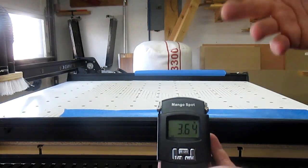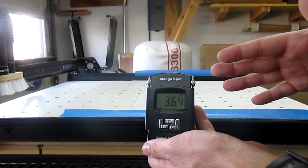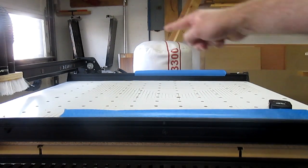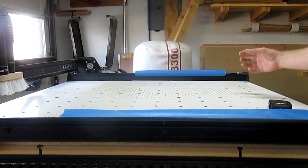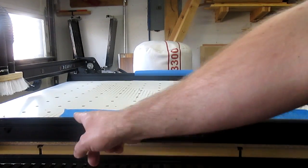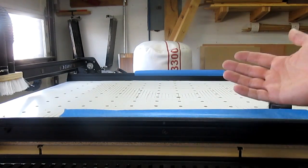I'm just looking for rough estimates here. For me, 3 and a half pounds seems to work really well. That's all it takes to tension the belt — you do it 1, 2, 3 times. You can pull the gantry all the way forward and check the X-axis from the front. It doesn't matter where you are, as long as you have the longest span of belt possible on the X and Y-axis.